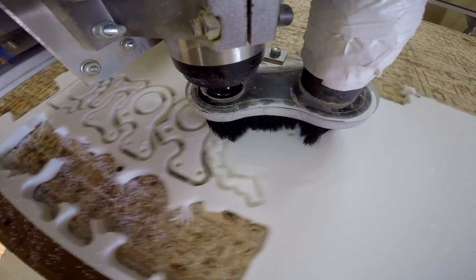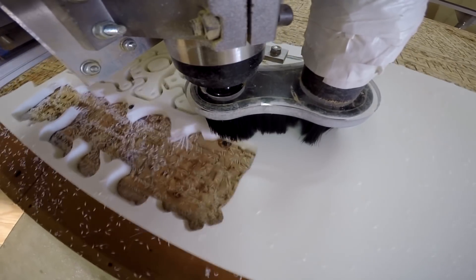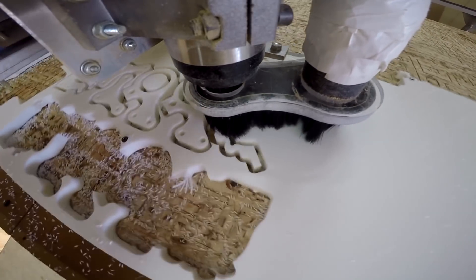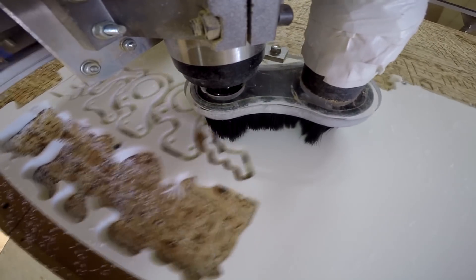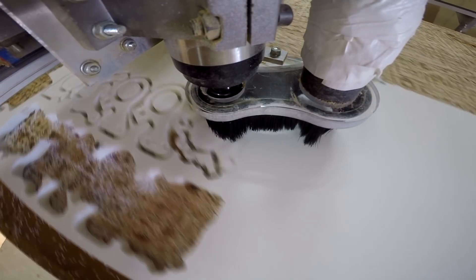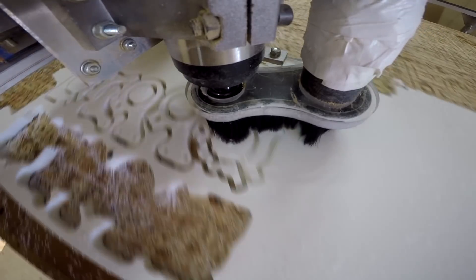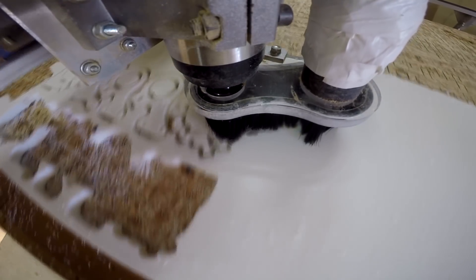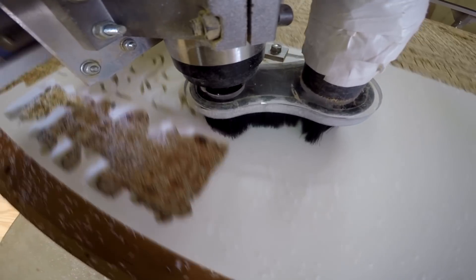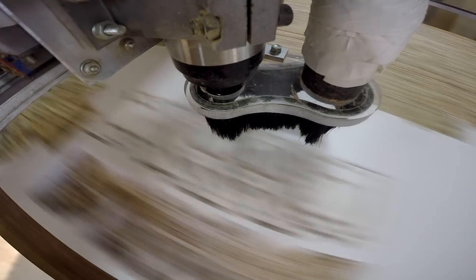This is the part I was talking about earlier. You can see the process of cutting one piece at a time, which reduces spindle travel. The spiral or zigzag worked out quite well. That zigzag is actually used to provide a little flexibility around the tube. The tube is glass, and that's one of the reasons I used HDPE — because it has a little bit of compliance, it's able to move slightly, especially when you design a zigzag like that. You can actually move it around and it'll form around the glass tube.